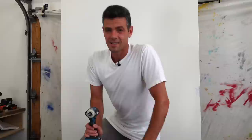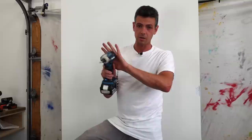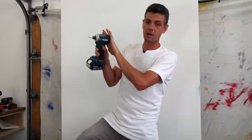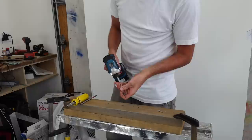There's one last tip I did there that's really handy to help you make sure you're sinking your screws — it's also especially helpful when you're pulling screws out. Notice that I put my hand on the back of the drill. Not only do you want to visualize that straight line from the back of the drill through your bit and screw, it can also be really helpful to put a little pressure on the back of the drill, especially if you're in awkward positions. A little bit of pressure on the back of that drill goes a long way.